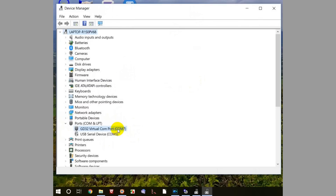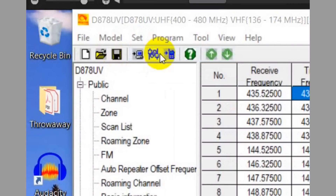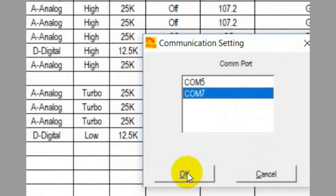Device manager will show all the active COM ports. For previous videos, I loaded an AnyTone driver for version 1.10, a D878UV without Bluetooth, and it's very possible that the PC picked up that old driver, which is why you see a driver starting with GD. In any event, this is the one you want — in my case, COM 7. You must tell the programming software which COM port to use; it does not find it automatically.